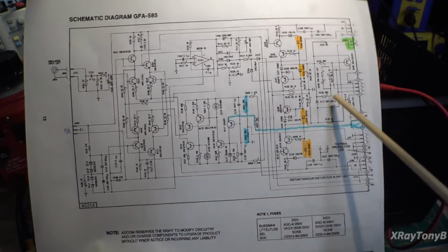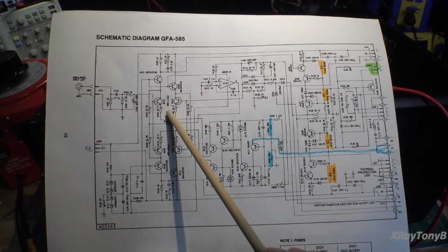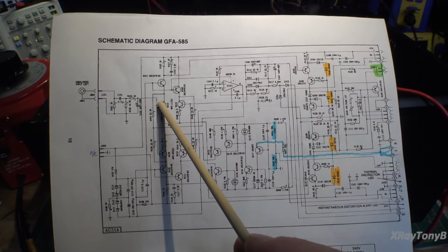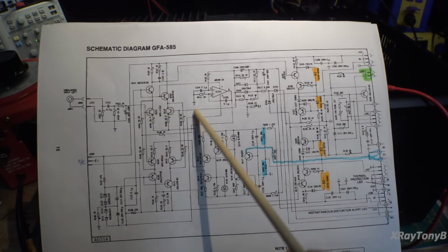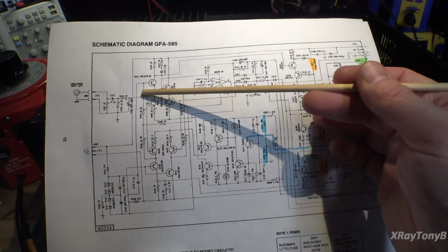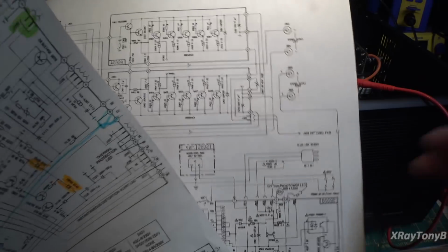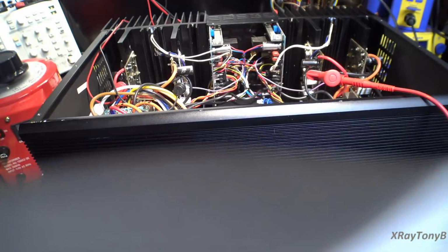Now, all of that is influenced by all of this. If you notice, these are those very closely matched transistor pairs at the very beginning of our preamp. And these little differential pairs, if they are not matched and not biased perfectly in the middle, it'll carry all the way over and throw off our output.